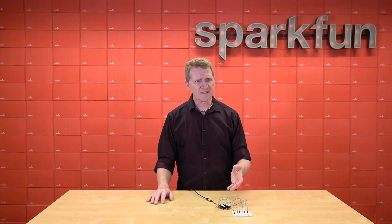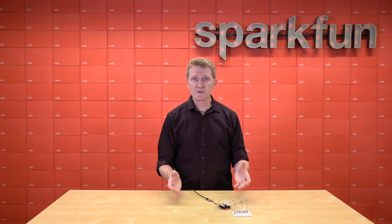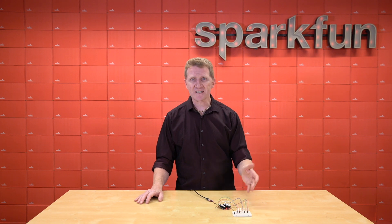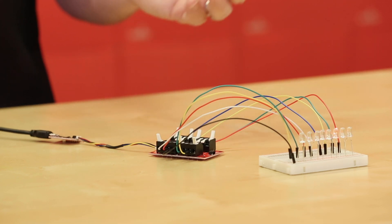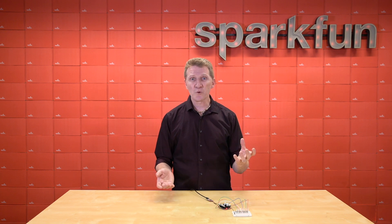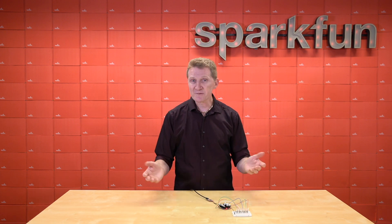This expander IC is really simple and straightforward, but to make life even easier, we've put together an Arduino library as well as a Python package with examples for both. I wanted to throw together a quick example, so I just went with a Larson scanner. Seriously, if this thing took me five minutes total to put together, I'd be surprised. For the hardware, the latch pins and the Quick Connector made that a breeze, and for the code, I just took example 1A from our hookup guide and the Knight Rider sketch from Arduino's website and kind of smashed them together, and that was it.